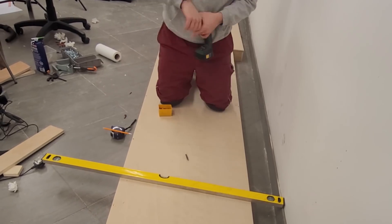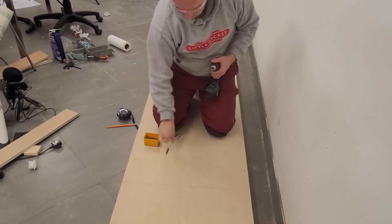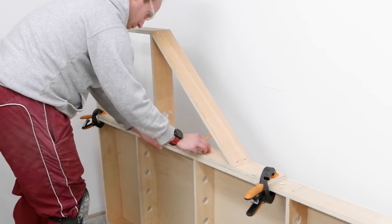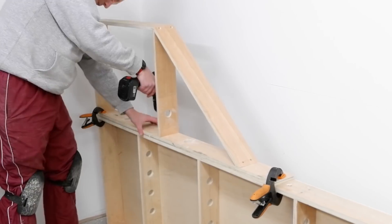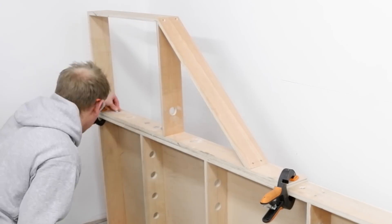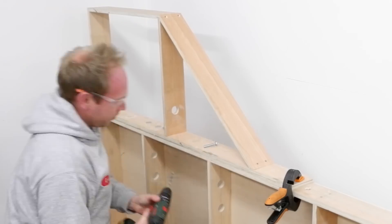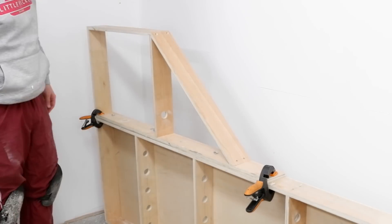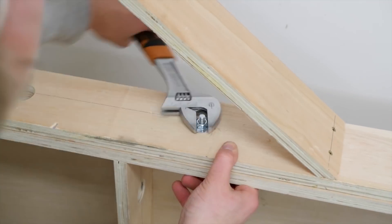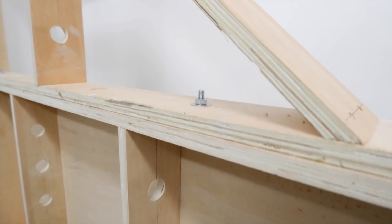It's at this stage that you can correct any slight warping in the frame by making sure it lines up perfectly with the edge of the board before screwing. I used three screws for each cross support — one at either side and one in the middle. I then made the smaller frame for the return loop, clamped it in place next to the larger frame, and drilled holes for the wiring between the two boards. I also drilled four 8mm holes which will take the M8 coach bolts connecting the frames together. The coach bolts have a square neck designed to stop them turning once inserted — once you start tightening the nut the square part just sinks into the wood and they feel really secure. I used four bolts to hold the smaller return loop frame to the larger frame.